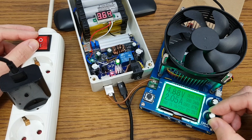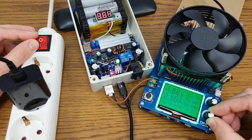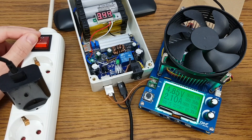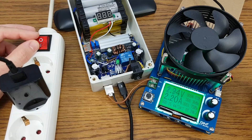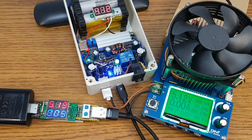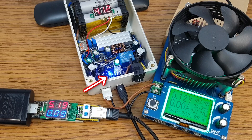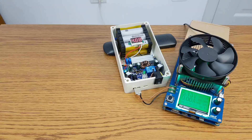But I will continue to test the UPS in extreme conditions to be sure that it works and it's safe. I will increase the load to 2.1A while the battery is still being charged — the rated power of the charger is now exceeded. I will simulate a power outage: the output of the UPS is stable. It can switch to battery backup, back to mains again, without any problems. Let's increase the load to 2.2A and cut the power — the output voltage drops, so no good. But what if the battery doesn't need any more current? The blue LED on the TP4056 module indicates the battery is fully charged — only the UPS circuit draws 90mA from the charger. Now I can increase the load to 2.5A, but the current draw from the charger exceeded 3A again — I need a better charger.